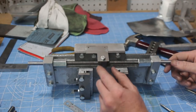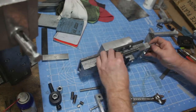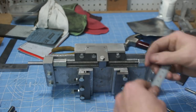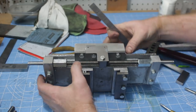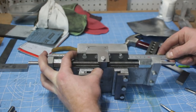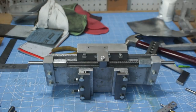I've got the bracket attached to the cross slide drive block, and I need to make sure that I get the full range of travel here. So what I'm going to do is measure from the outside of the cross slide feed block to these coupling nuts and make sure that they're equal. It looks like I've got about 71 millimeters on either side, and now I want to position the cross slide so that it's in the middle of its range of travel. That puts it at about 72 millimeters — 140 millimeters, which is in inches about five and a half inches of travel left and right.